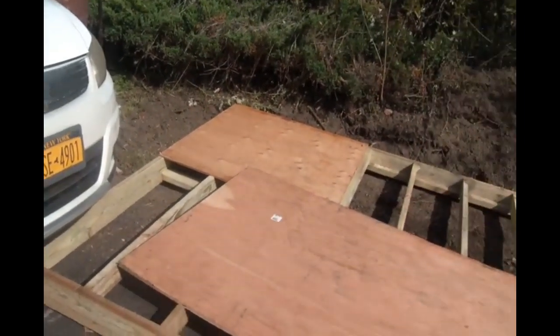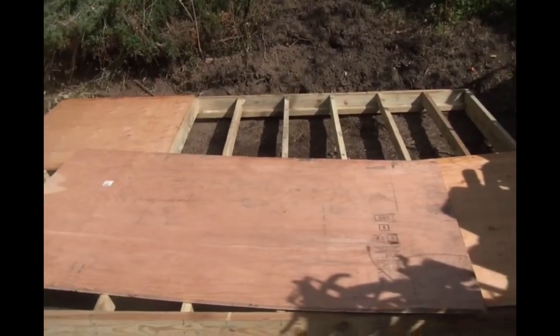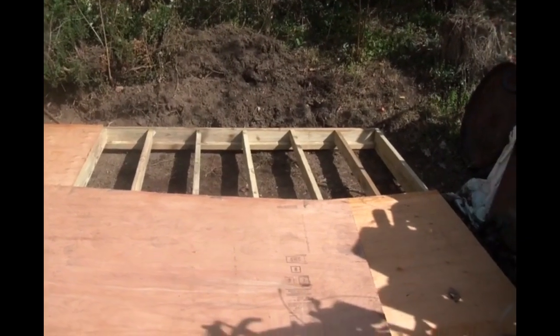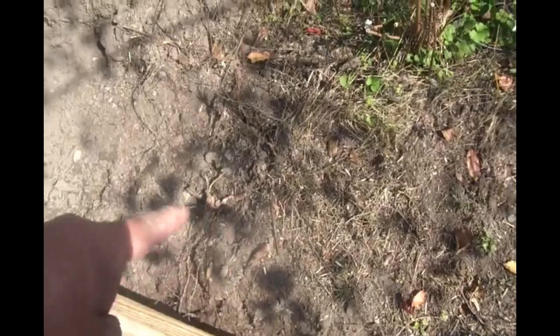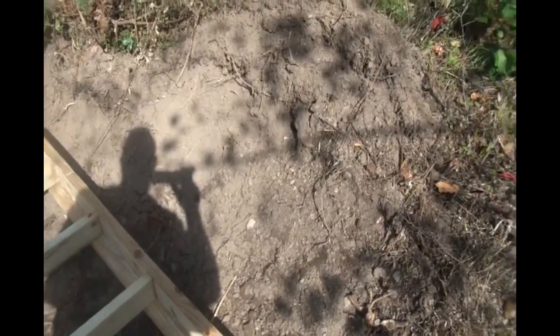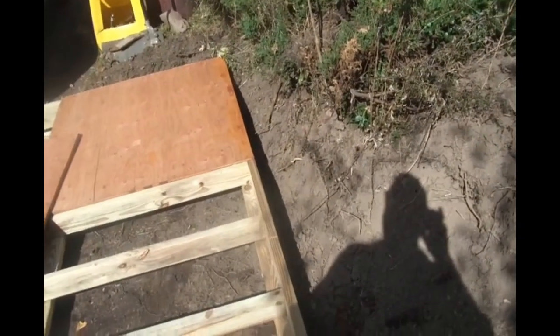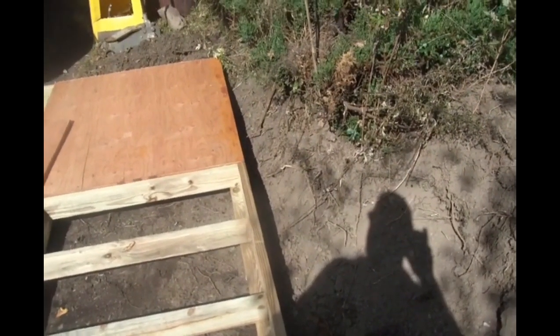I think I'm going metal roof, and just going with an incline roof — nothing complicated. A shed roof draining toward the back. I moved this dirt wall backwards, and it probably wouldn't be a bad idea before the shed's up to clean this up and move it back just a little further. Having air space behind the back wall is always a good thing.